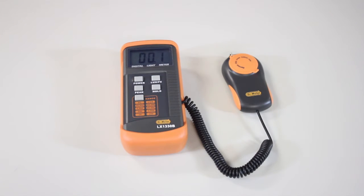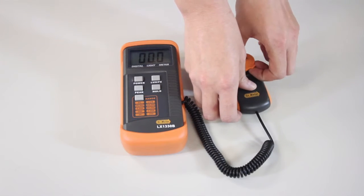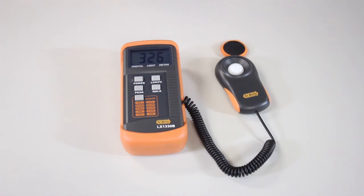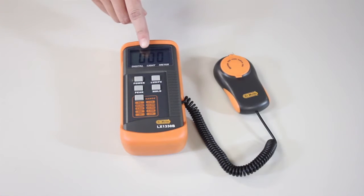To calibrate your lux meter, power it on and make sure the cap is closed. When you're ready to take your measurement, take the cap off. If the most significant digit is one, you need to change your range, so press the range button until you get a number — for example, about 317. When you want to take another measurement, always recalibrate: put the cap back on, make sure zero is displayed, and then you're ready.